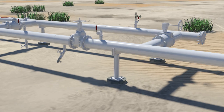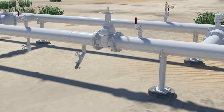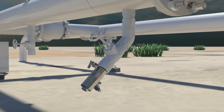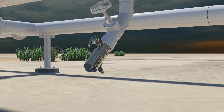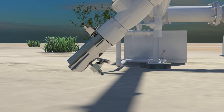As you can see from our location, we used an existing 2-inch connection located under a release valve. Let's begin by shutting down or closing the isolation or safety valve so that the Excalibur Shield is isolated from the main pipeline system.